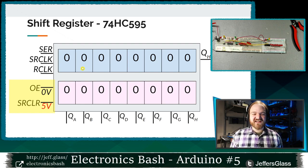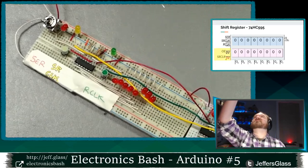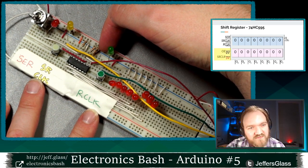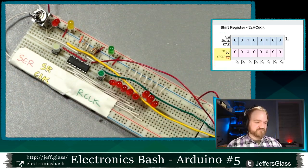Just to show you that visually on our diagram we've been using, the OE pin I've tied to low, so I always enable the outputs, and the SR clear, the serial clear line, I've tied to high, so I'm never clearing my outputs. You can see that actually on my breadboard here. I've just used these little bits of wire to tie. I think that one must be the SR clear. It's pulled high with that little red wire going to my power bus here. And that little white wire is going to my output enable. It's tied low, so it's always outputting.